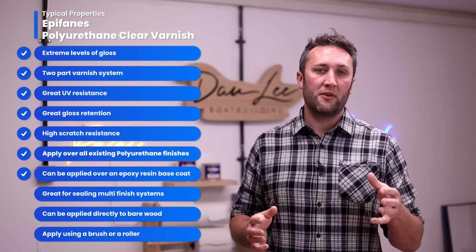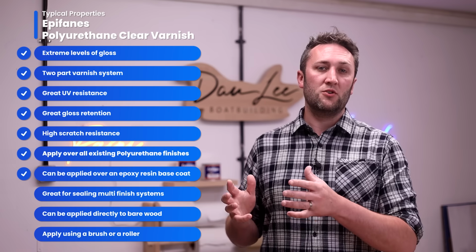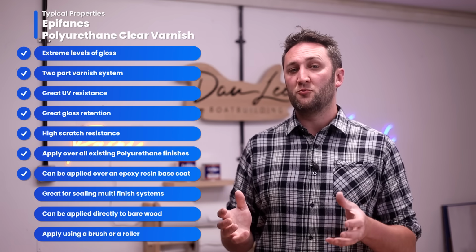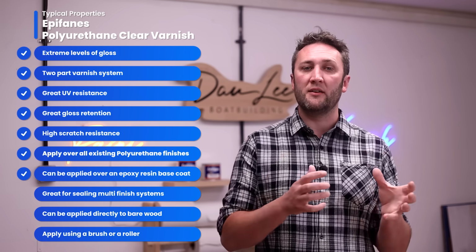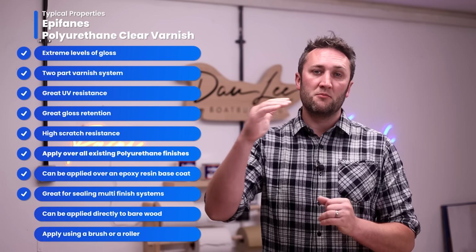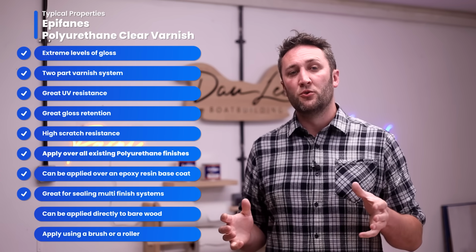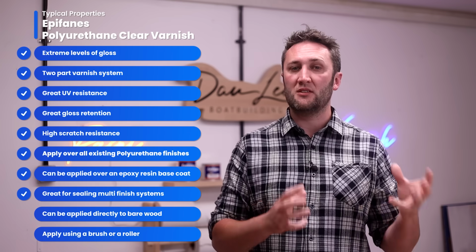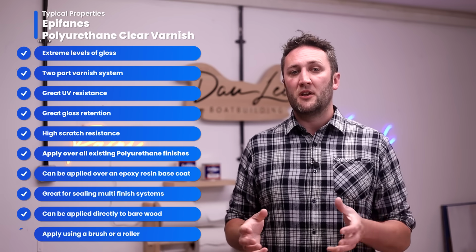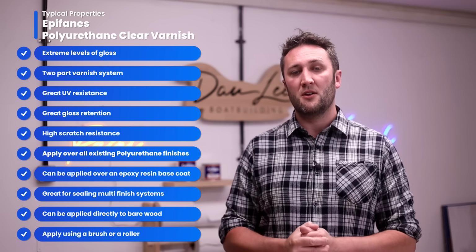It can also be applied over the top of polyurethane paint systems, should you wish to gain an increased depth of colour and gloss, surface protection, or just a well blended and sealed multi-surface finish where varnish systems meet into paint systems. This varnish can also be applied as a complete standalone clear finish to bare wood. For best results, application should be done by brush or roller, so let's take a look at how that's done.